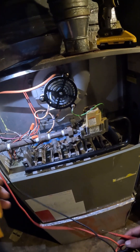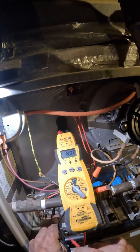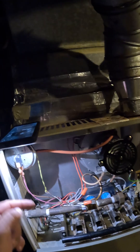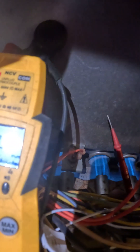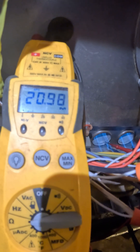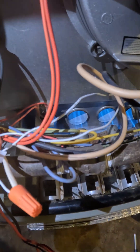I've showed this before and I'm gonna show it again. Some of you may not know this, but if you go to ground and then measure to that flame sensor, we're reading 81 volts — so it's putting AC voltage into this probe, there's 80 volts on that probe. I've got it grounded on one end, and this end is in the air. You can see we have nothing on the meter, but as soon as I stick this into that flame, you can see we have movement on the meter. I'm not gonna put it in the flame very long because I don't want to melt it, but that just shows you that electricity will travel through a flame.